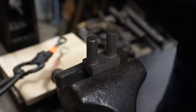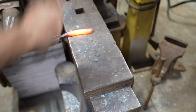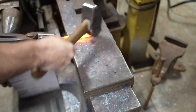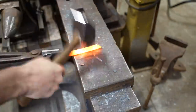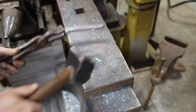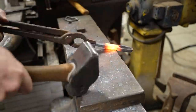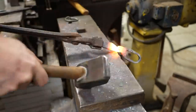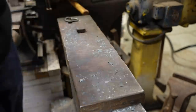I've got these little bending forks in my vise, and I have my wooden form and my plan next to it so I can get it close. Here I'm just forging out the blade, trying to be really deliberate with my hammer strikes — not hitting super hard, just drawing out that piece of material and trying to get it nice and square. I'm using what's called a Hoffie hammer, designed by Ori Hoffie. My friend Jeff Fader turned me on to these — it's got a pretty flat face on it, which is nice for keeping flat edges on your material. I move over to the larger side of the scissor and put in two shoulders for the sort of bend that I had seen on the model pair I'm basing these off of.